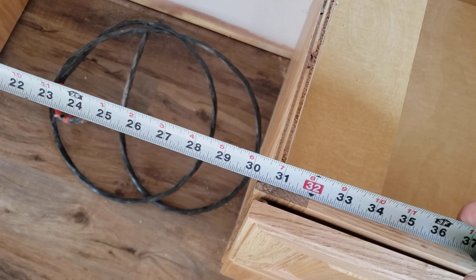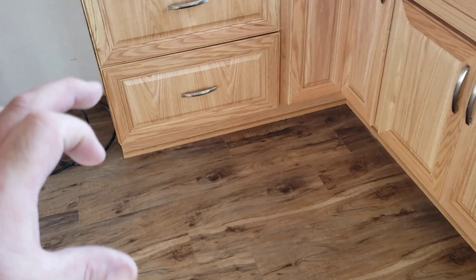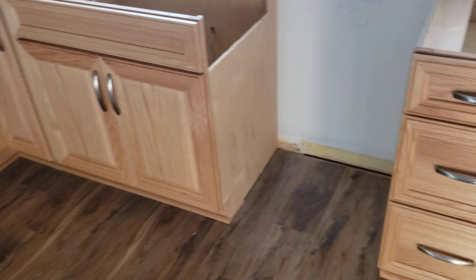This floor did have a little bit of a drop — from there to here is about three-quarters of an inch. So I always order the wider 8-inch toe plate and cut that to size. It looks so much better instead of having to drop the plate down on the ground; it gives you a full plate on the front. We cut the 8-inch down to about 5 and a quarter for this area. Double drawer boxes here, a few extra pieces of handles and knobs — everything's working.